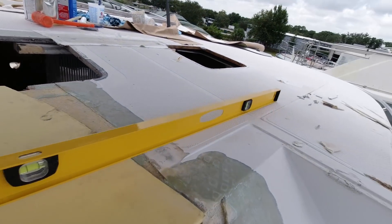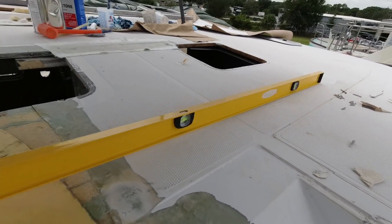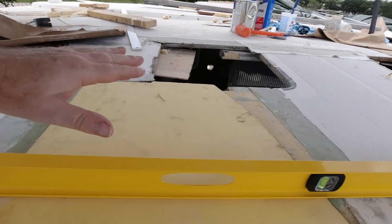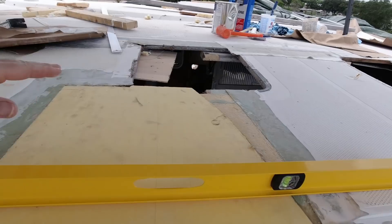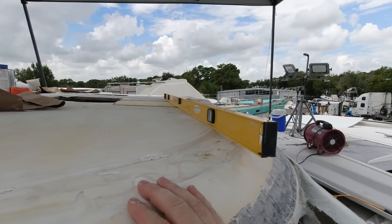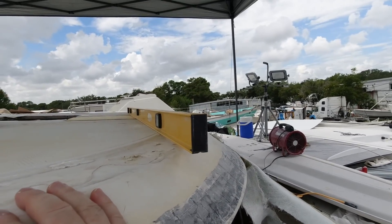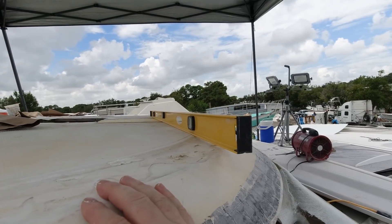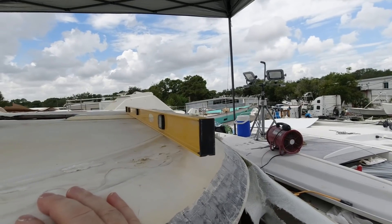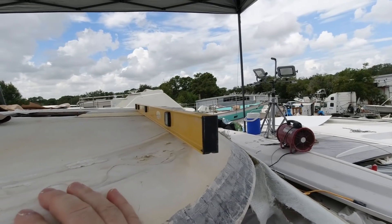What I'm doing is checking one side for fairness, and then coming back to make sure this side is going to be fair so that I don't have any high spots or low spots. I'm making sure I have this thing perfect as far as into place. The key is to make sure it's a little low — low spots you can fair out. I don't want it more than an eighth of an inch low, but low spots are fine. You don't want any high spots.